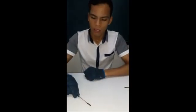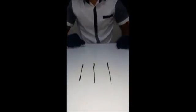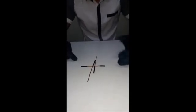Now, in making the cross joint, we need three wires. For the first wire, the insulation was removed like this. And the other two wires, the insulation was removed this way. We make a cross position. The first wire will be twisted clockwise and the other wire will be twisted counterclockwise. The same procedure as in making the plain tap joint.